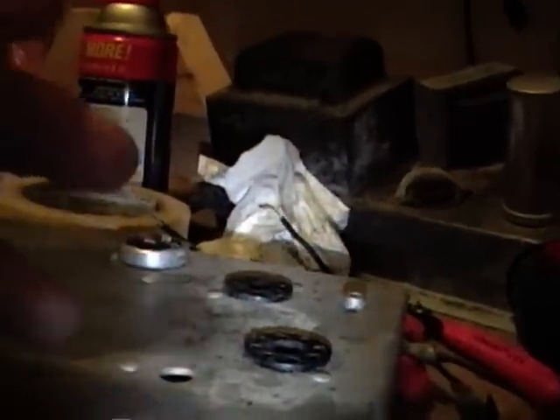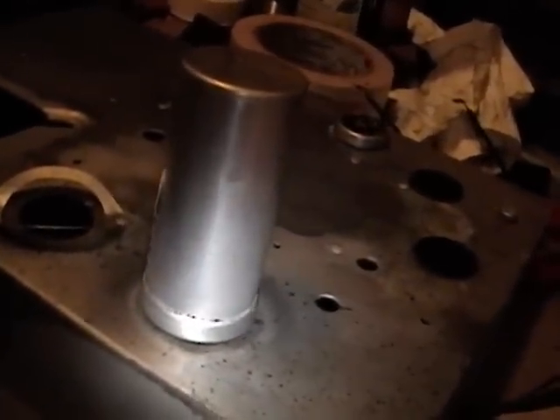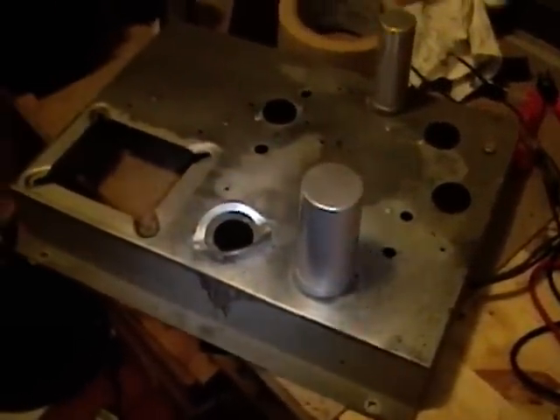For resealing, you've got a few options: JB Weld, two-part epoxy, or hot melt glue. I'm not going to glue it until the whole thing is working, because the last thing I want is to have to cut it back open. Even when I do glue it, I tend to use a mild glue or just a couple of small dabs. For the gap, you can fill it with a little putty, and if it stands out, use a little silver model enamel paint with a brush — a casual observer will never notice. Then put the tubes back in, put the transformers back in, put it back on the set, and hopefully it'll work.